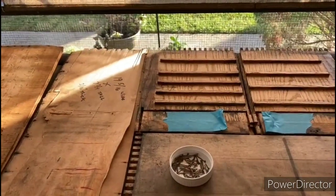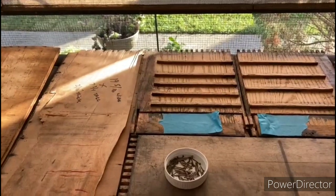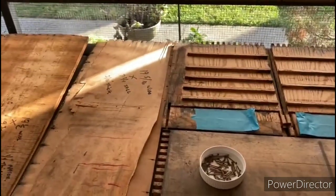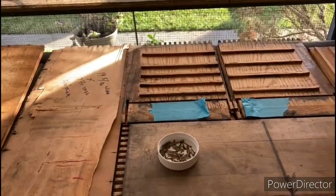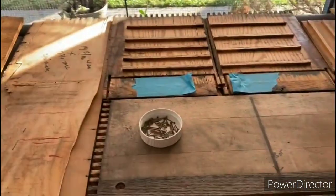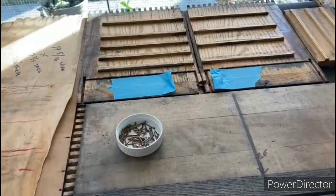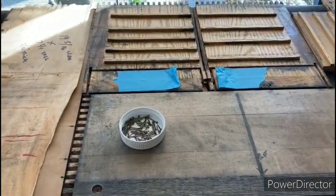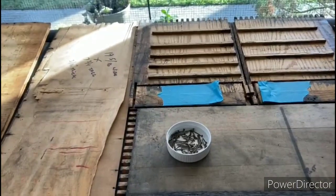When you're using hide glue, it comes apart easily with steam, or sometimes just even tapping it, and the pieces will separate. But when they made their repairs, they used something like a carpenter's wood glue, and that made it a lot more difficult to get these pieces separated. Additionally, they reinforced this area with a bunch of extra nails. Some of these nails were in there from the factory, but about half of those were added by the previous owner just to reinforce these pieces that were bad.